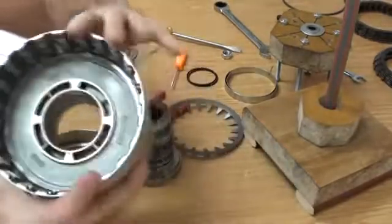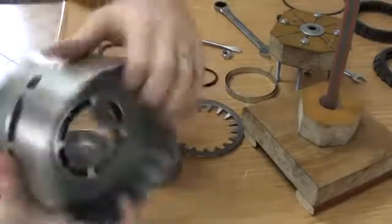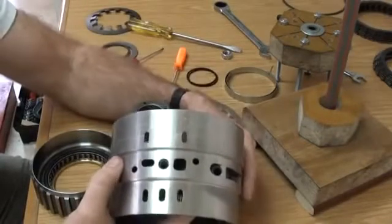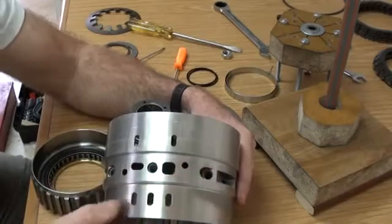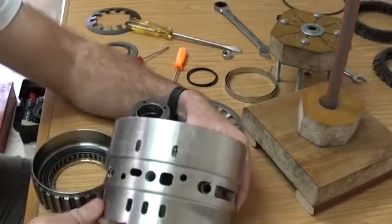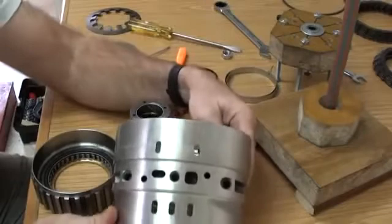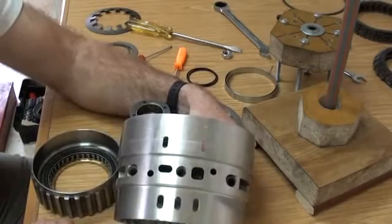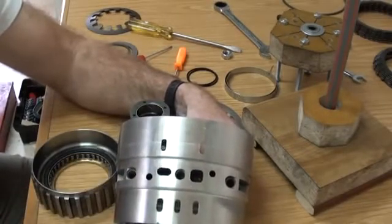On the inside of both sides of the DG drum are pistons — there's a big one there as well on the other side. This is bolted to the transmission housing, so there are three holes that have oil going to them. The two circular ones here go to the DG clutch on this side, and the third one goes into the centre part and into the F clutch. To remove those pistons you can either give it a whack down on something hard that won't damage it and they'll pop out, or just put some compressed air into either of these holes and they'll pop out straight away.